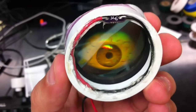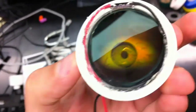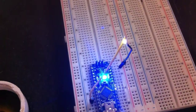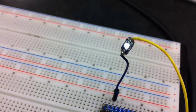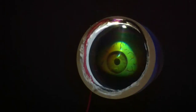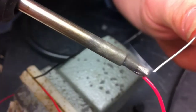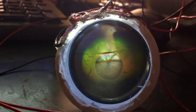For the actual holographic eye, we disassembled some eyeglasses found in a costume store. Initially we wanted the LED to do quite a few things, but as the timeline came down, we decided on a simple pulsing on and off using Gravitek's little nano board, which was a great little board. Here you see Jonathan programming the brightness cycles. We did not like the way a single LED made the eye look triangular and weak, so we soldered two more LEDs onto the eyepiece, bringing the total to three. The extra lighting really fleshed out the hologram quite nicely.